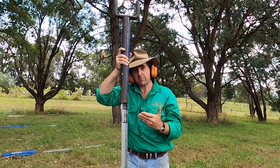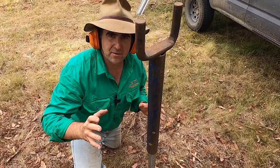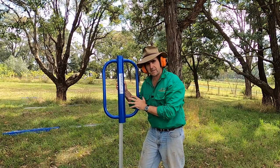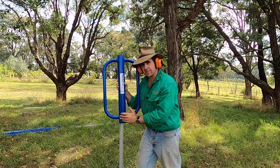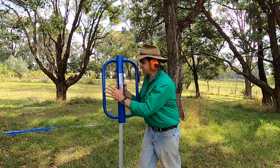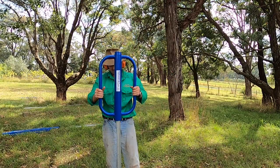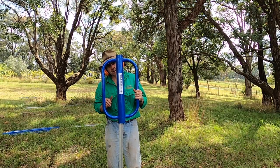Not only that, it's going to take forever to get this post into the ground. One saving grace if you are using a short post driver with the stock post is that they come pre-marked, so you know exactly how deep you're driving and you don't have to measure. Next up we've got the short fence stay steel post knocker. This one's a larger diameter so it fits on the post more easily. It has the feature of handles from the top to the bottom — if you're looking for a good quality post knocker that's going to be safer, this is a feature you should definitely look for. Your hands are always kept well away from the post you're driving, just in case you overextend and come down beside it. This is a heavier commercial style knocker and I'm not having to reach outside my range of movement.